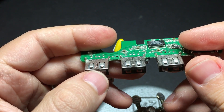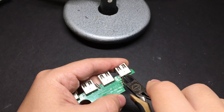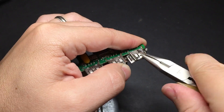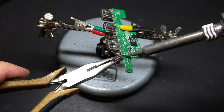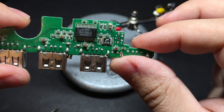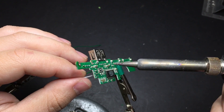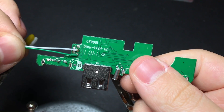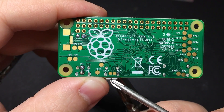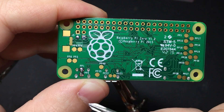Removing the actual ports can be kind of a pain. One option is to cut them flush with the board like we did the cartridge reader — that'll leave some pins on the other side that you can solder wires to really easily. By removing them we can save a lot of space inside the Game Boy case. These are the data wires that will be connected to our Raspberry Pi. We can temporarily wire up 5 volts and ground directly to the Raspberry Pi to power it. The white and green wires will be connected to pads 22 and 23 — 22 will be the green wire and 23 will be the white wire. Pad number one is 5 volts and then there's ground. Wire it up and test it to make sure you didn't damage anything.